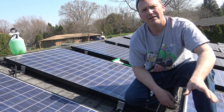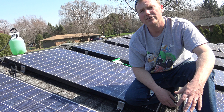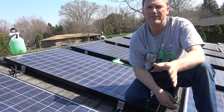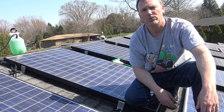Right now it's about 2:30 in the afternoon — I should be putting out maximum output, which is right around 8,500 watts. Before I came up here, I was at about 5,700 watts. Once these are all nice and clean, you're going to gain around 2,500 watts depending on how many solar panels you have. Hope this video was helpful and informational to you, and thanks for watching.